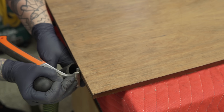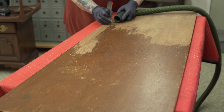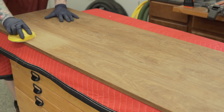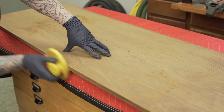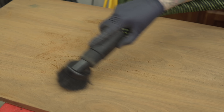A lot of people hate this kind of furniture because inside this veneer sandwich is usually pressed wood, but it gives a nice flat stable substrate that doesn't move with the weather. Now I mentioned this was likely in a flood situation, but there's not big chunks of veneer missing — the top and bottom are completely covered and intact, with just a few tiny chips along the corners. This is kind of a testament to the fact that if a presswood substrate is enclosed and sealed properly with a good finish, it's not the garbage a lot of people think it is. Actually the majority of mid-century furniture is constructed this way.